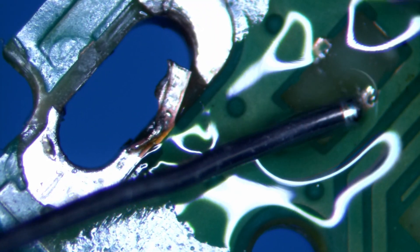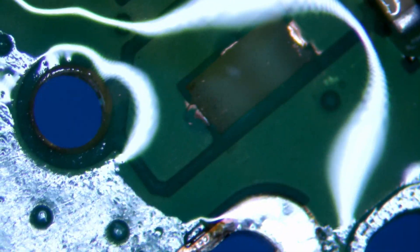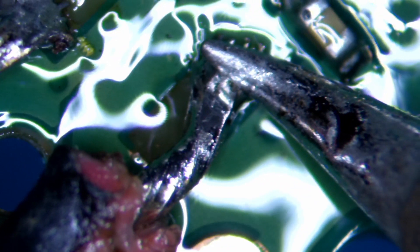We want to make a little bit of space and recreate what those pads were doing before — which is just connecting the top part of the USB. We need to dig a little bit first to see that pot of gold, then put a little bit of solder on each of those connections to recreate the connection on the USB. It's going to look a bit freaky, but it's definitely a good way to at least get the data. We're just recreating exactly what each of those pads were connected to before.